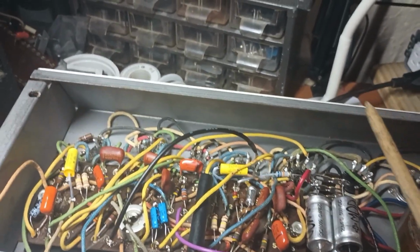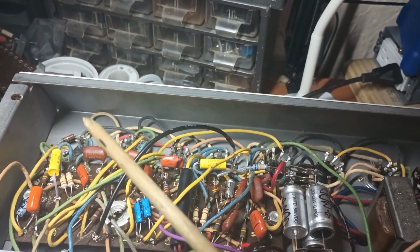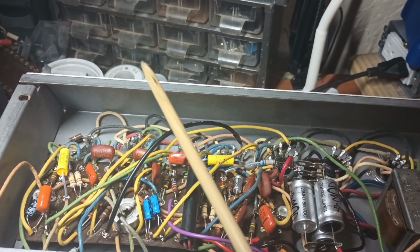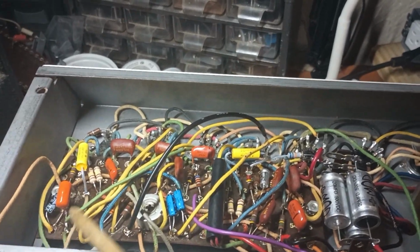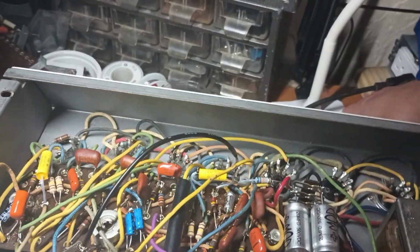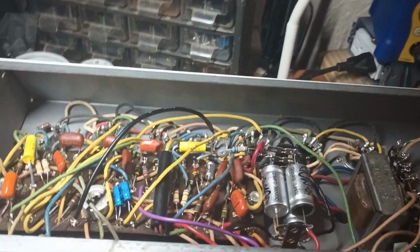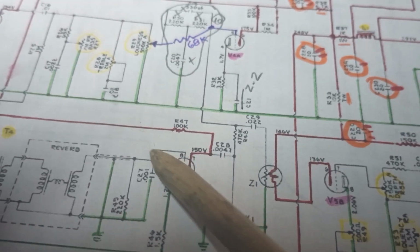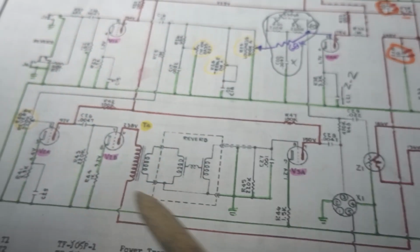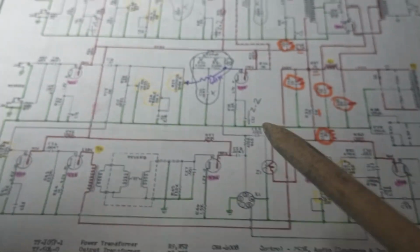So, besides your brain, your ears, and your eyes, the most useful and important tool to an amplifier repairman is a chopstick. And that's how we found that problem right there. That green wire is... Where's Mr. Schematic? Uh-oh, little lamp died again. So what was disconnected was this guy right here. It's a grid wire going into the reverb recovery stage of amplification,